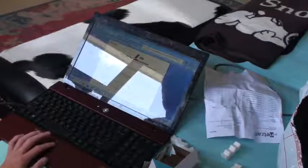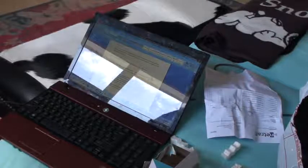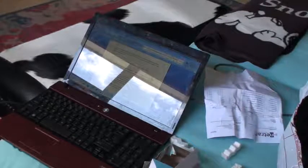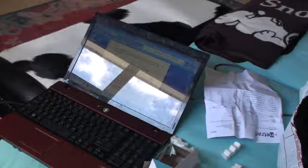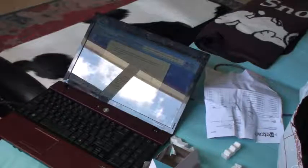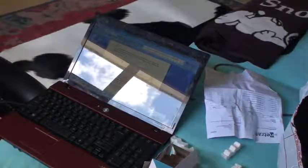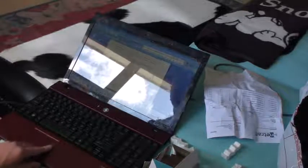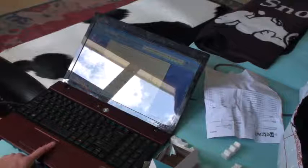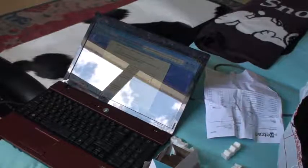Then the PS2 test, which is a keyboard type — it's much easier to interface than USB. Then a full test where I'm going to make a little program that tests all three things: PS2, SD, and TV out, which is television — by making a little application where you'll be able to type stuff in, it will appear on the screen, and when you push Enter, or F1, or some button I'm not using on the keyboard, it will save it to the SD card as document.txt or some text file. I'll implement loading and saving and different file types. And I'll work on BIOS and all that — that's probably not important to you guys.